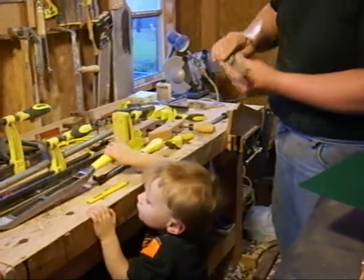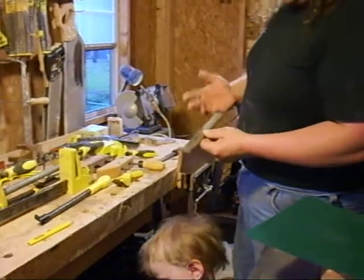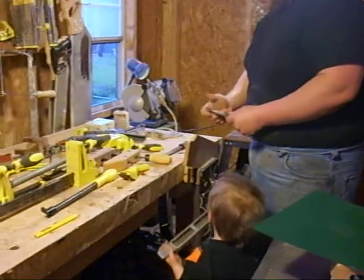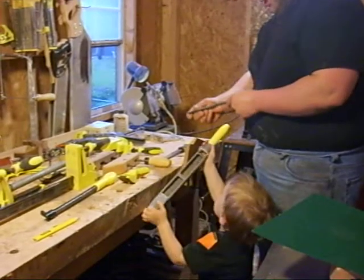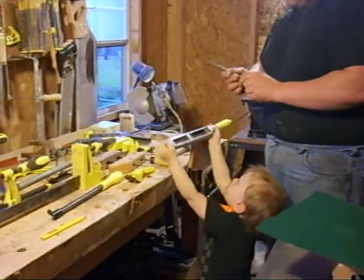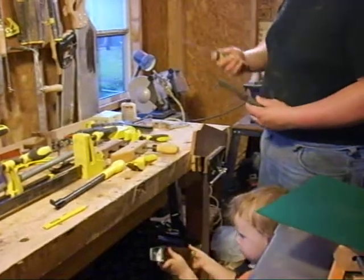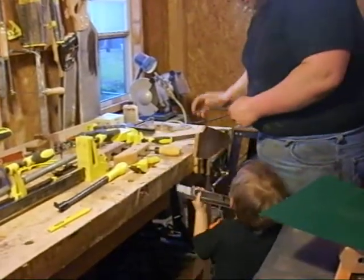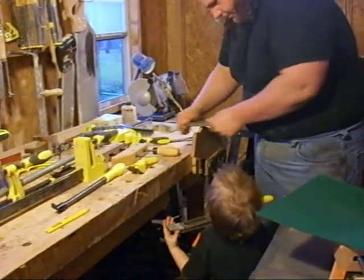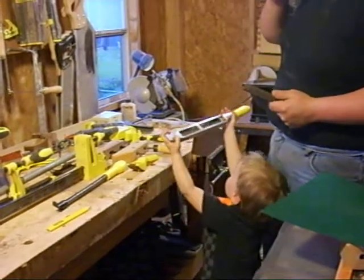Files have little teeth — little notches — cut in. I actually use them more for metalworking than woodworking, although what I like to do is use either a rasp or a surfform for initial shaping, then follow it up with a file just to make it pretty, clean things up, and also make sanding later on easier.